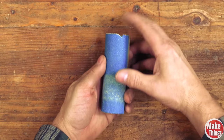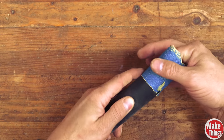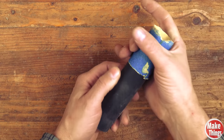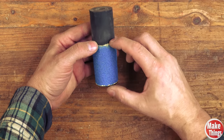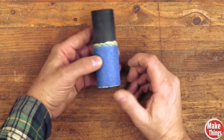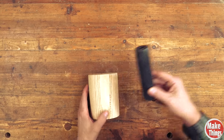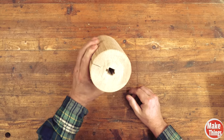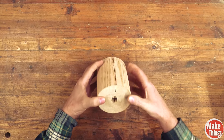One thing I really like about this is I don't have to make the full length either. I can use half of a piece — you'll have to figure out where it's going to land. For a three-quarter inch to an inch thick piece of wood, this half length works perfectly, which saves even more sandpaper. But what if you don't have a roll? I've been wanting a four-inch spindle for a long time, but it was something like $70 on the website, so I just made one. This is oak.